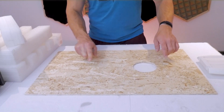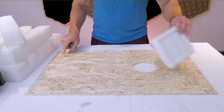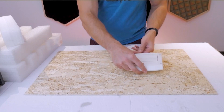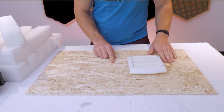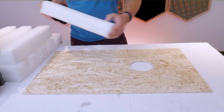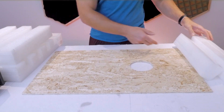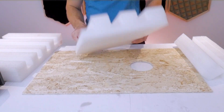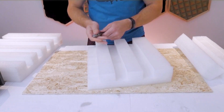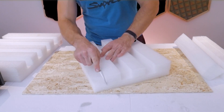Next you're going to need a piece of plywood — in this case I have a piece of OSB that I had laying around — and you're going to cut it down to dimensions smaller than the inside of your window frame. It doesn't have to be precise. We're going to be filling the gap with some foam. I have these quite large foam blocks salvaged from packaging, so you can definitely scrounge around. The foam just has to be soft enough to deflect and conform, because we're going to be pushing this into the window frame.